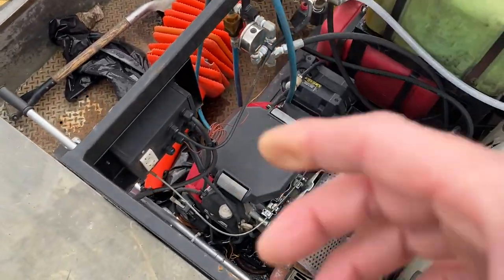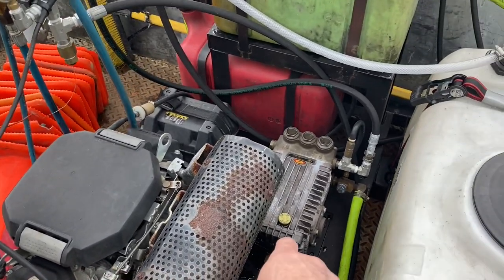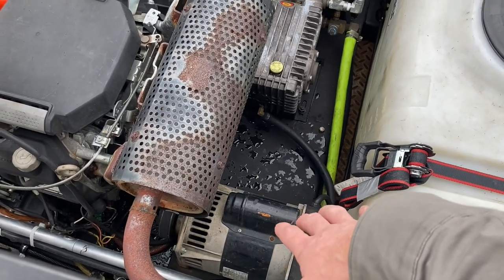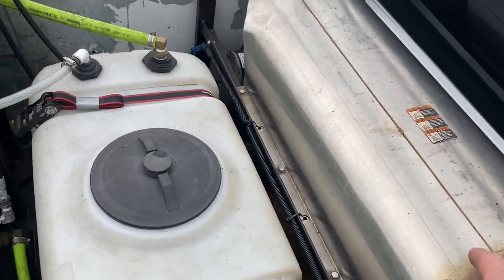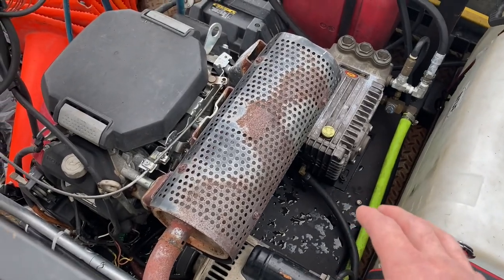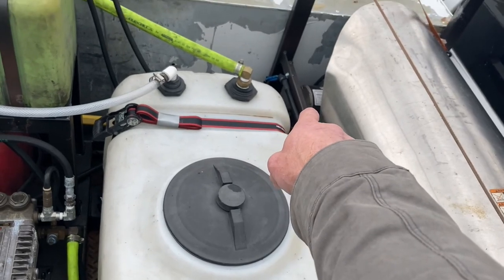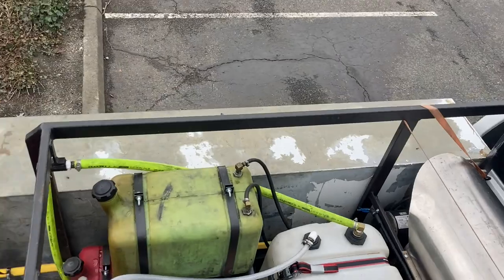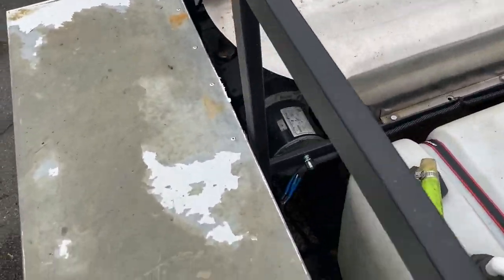You have the small engine here. It's about a 24 horse Honda engine. There's a pressure pump. And then also these systems have built-in 110 volt generators, which are really good because the types of systems that fire these burners come in two flavors, 12 volt or 110 volt. The 12 volt systems, which are a little bit less expensive, use the charging system on the engine to fire the Beckett oil burner, or whatever kind of oil burner you're using. It's just a kerosene or diesel burner, which is mounted on the end of the coil.